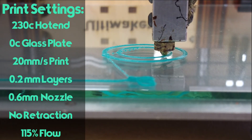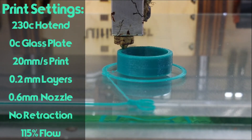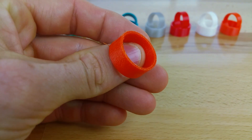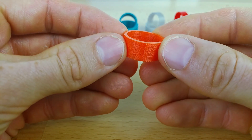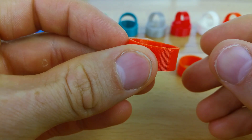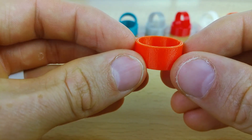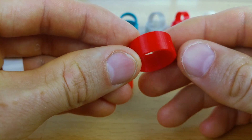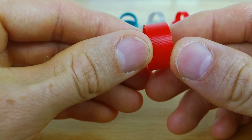You can tell a lot from that first layer, so watch it carefully and make sure it's going down smooth and evenly. My first go at printing this ring, I printed it very hot and slow. This caused a really rough surface finish and under-extrusion where the two perimeters weren't bonding. So I tried another one, but I sped up the print speed and decreased the temperature. That drastically improved the surface finish — a lot more smooth and there was less under-extrusion. I continued to change the temperature and print speeds until things smoothed out. I ended up at 230°C for the print temperature at 20mm/s for the print speed. I also increased the flow to 115%, which made sure to close the gaps in the perimeters.